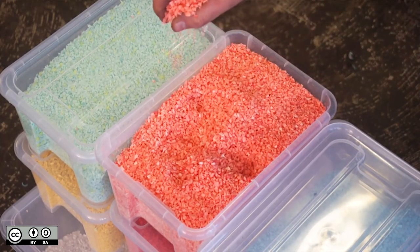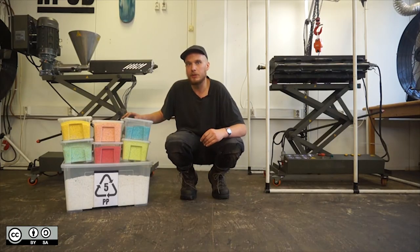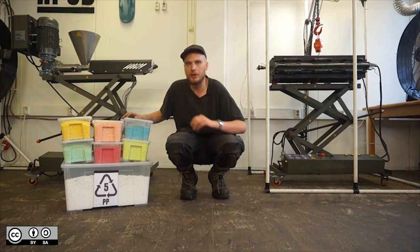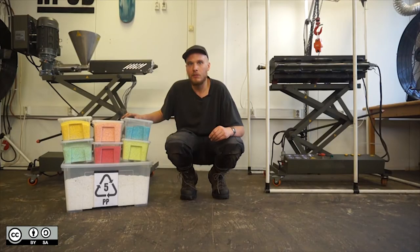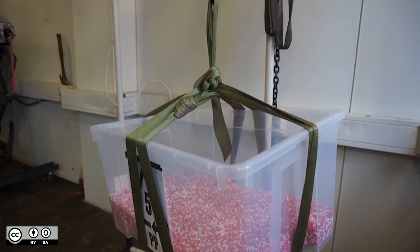Before making a deck make sure that you have a good source of plastic available. We recommend polypropylene. It has nice pop which means it's good to skate, it doesn't stick to the mould and it's relatively safe to work with. You can get a larger batch of white and then smaller batches of colours because it's possible to mix the colours with the white to make a larger batch of colour. You're going to need flakes less than 5mm — around 3mm is perfect.